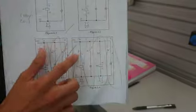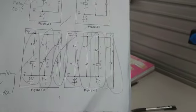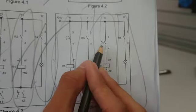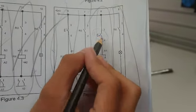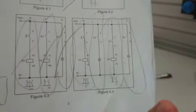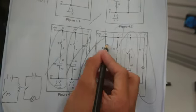The fourth circuit involves 2 normally open contacts and 2 switches, which are these retain switches. When we open, the coil will energize. Retain switch means it is not a temporary switch. This is the temporary switch, okay?